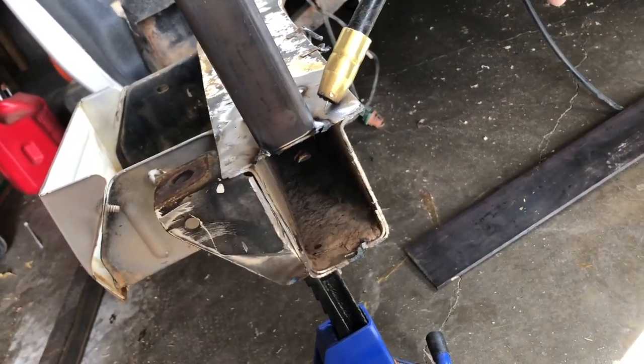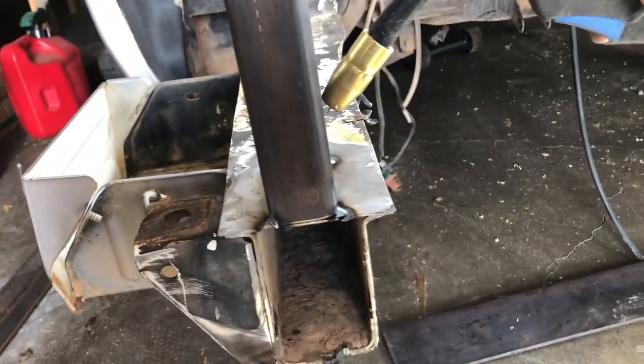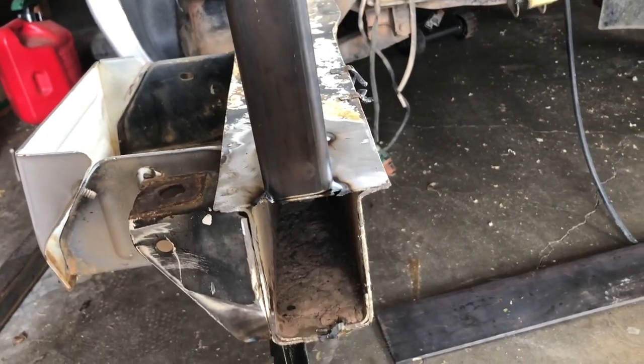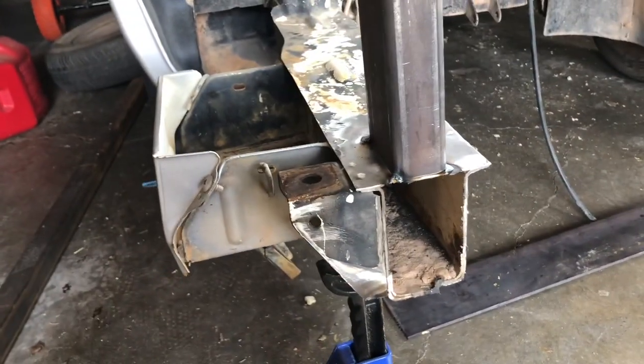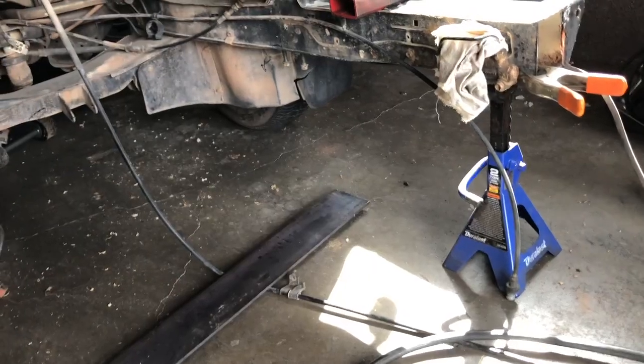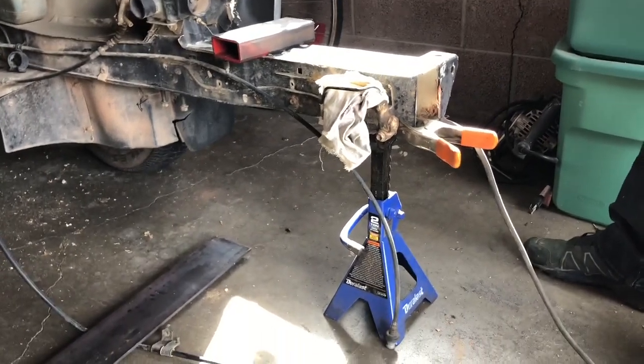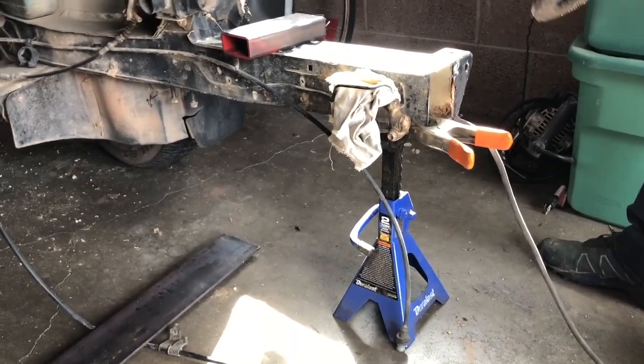You want to run it a little bit hotter than you typically would on this metal and a little bit colder than you would on this other metal — split the difference, it'll work. I really thought this would be like 11 gauge but it's really thin, it's 14 gauge. We just have to over-build the heck out of everything, because these are welds you don't want to fail — if they fail the truck folds in half.